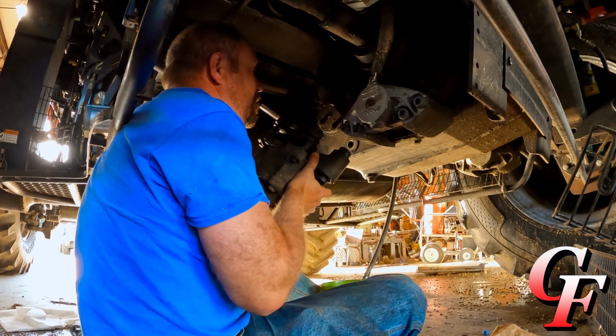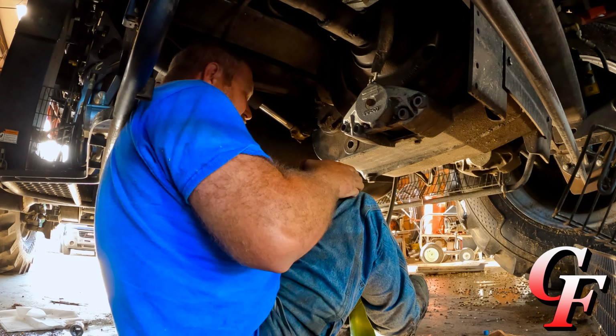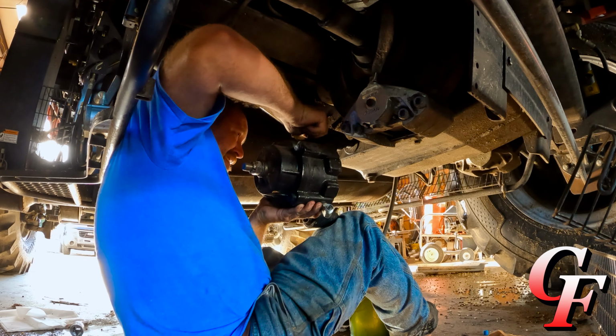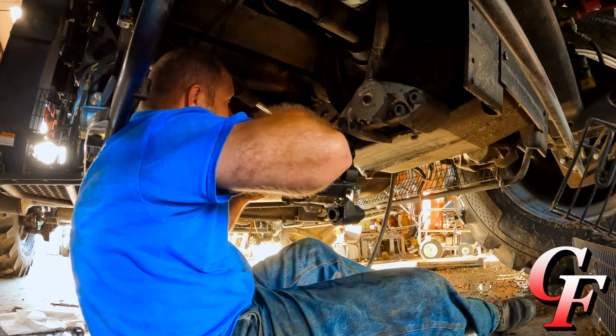All right, hopefully I got this spread back hard enough to go up on the disc. I don't think I do. Come on. Don't tell me you ain't gonna freaking clear. And I got on my crutch. Alright, my brake disc is about 21 millimeters wide, and I don't have my brake pads spread that far apart. That's why it ain't going on.